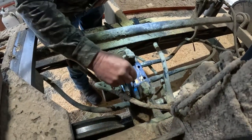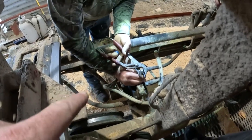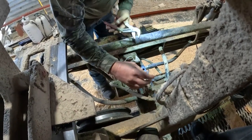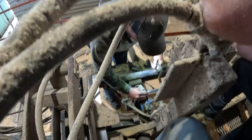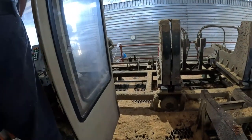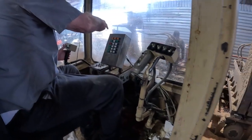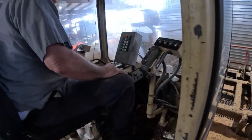Tommy has noticed a hydraulic leak, located at this valve. Charlie's tightening all four set screws down. If not, I'll have to take it off and put a new O-ring on the bottom. Let's crank this thing up for one second and make sure we stopped the leak. It's not leaking. All he's doing is moving his head blocks back and forth and pressurizing that valve.